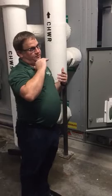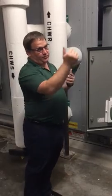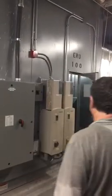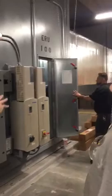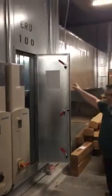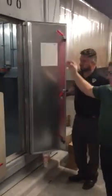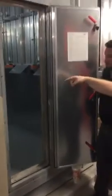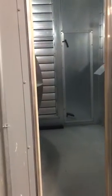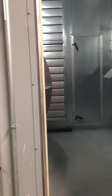So I'm going to start with the front end, or what I call the front end, which is the outside air, over on this side. We've got the outside air intake coming into the end of the unit. In this first section, you basically have your outside air intake dampers, which then go into your supply fan. At your supply fan, we have this cross flow baffle that helps the airflow so it doesn't go turbulent into the fan. I'm not sure if that's on every single unit.